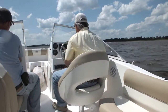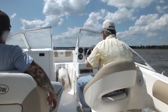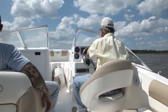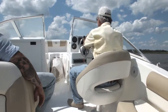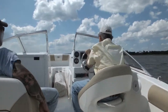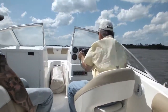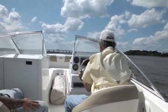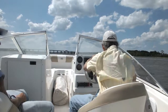What we're doing here is just taking the boat for a quick spin and test run, which is what we do with all Key West boats bought from Key West Boats Direct. Everything gets taken for a freshwater test to iron out any bugs and give everything a check through — check all your switch gear, make sure the live well, bilge pump, all these things are running, check the engine, check the telltale. If there's anything minor that needs a correction, we go back to the factory. 99% of the time nothing's wrong, and the boat goes back, gets washed down, shrink-wrapped, and put on the trailer ready to go.